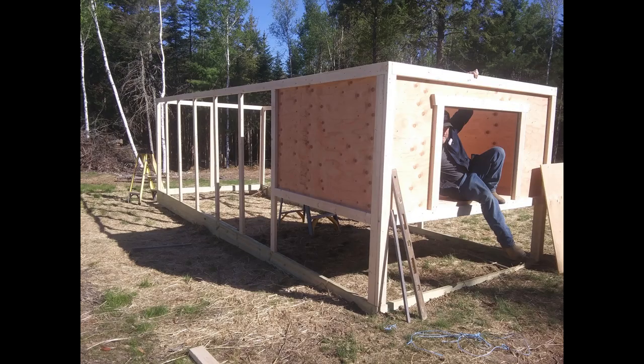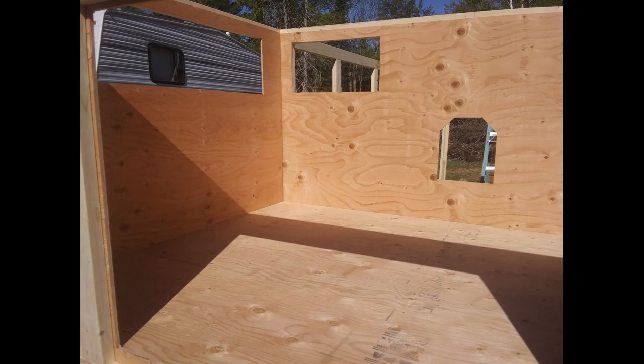Here's a shot of me gracefully trying to get out of the chicken coop, and here's a shot of the inside. One of the keys with a chicken coop, as you'll learn from Carolina Coop videos, is ventilation — you cannot have enough ventilation. The hole in the center with the angled top corners leads to the outdoor run, and it's about 8 inches off the floor because we're going to use the deep litter method and want to keep the litter from spilling out. We put two big windows on the left and right side and two smaller windows into the outdoor run, all covered with hardware cloth.